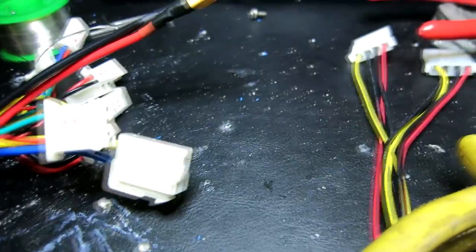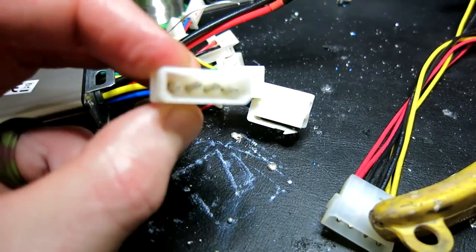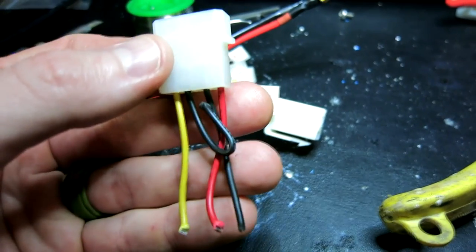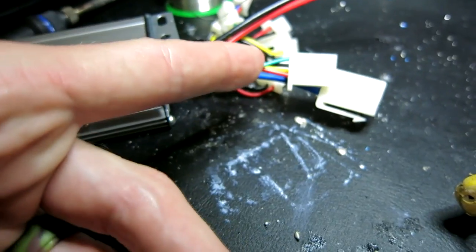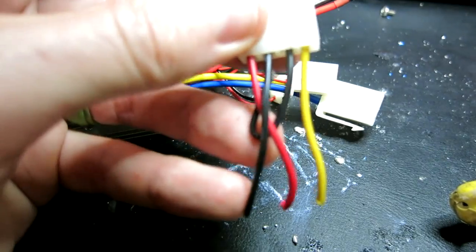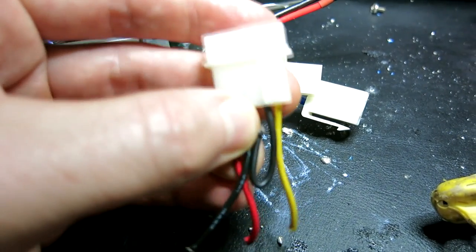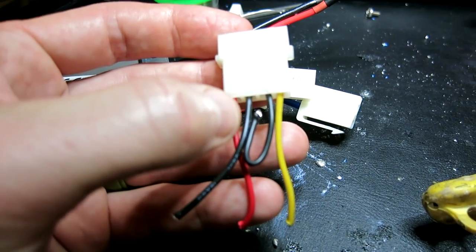What we're going to do is cut these three wires and take an old power supply connector from a computer — a male and a female — and use those wires. There are four wires coming out of it, so we're going to connect the yellow to the green, skip the second one next to the yellow, connect this black to the black, and the red to the red. The one right next to the yellow — skip that. We'll electrical tape that up and just use the black and red.